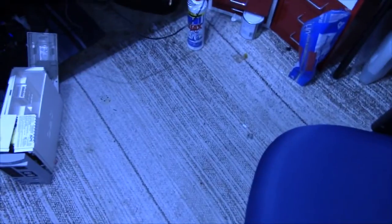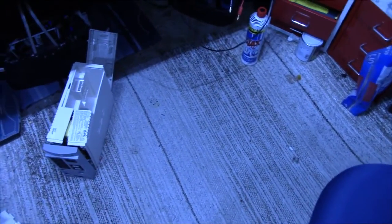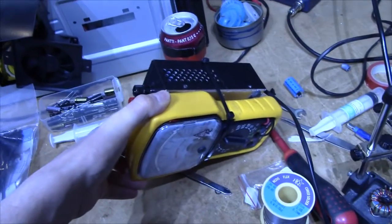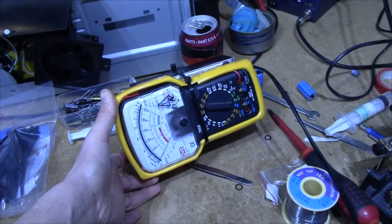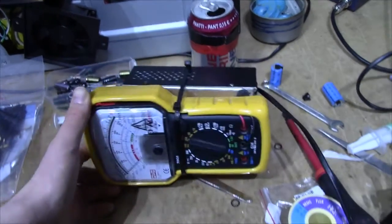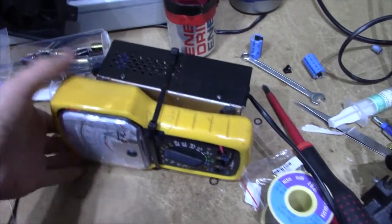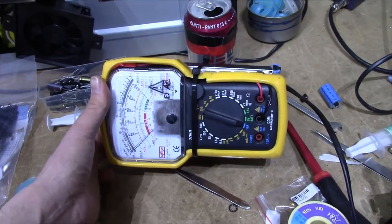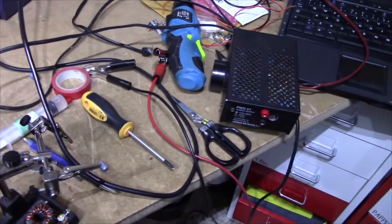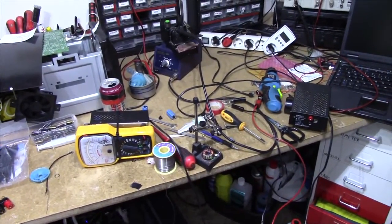I've made a couple of modifications to my main charger. I've added some proper connections - banana plugs instead of just a cable coming out. The output impedance of this charger with the old, very long, thin leads was about 0.3 ohm. Even running through this cheap current meter and the new connection, it's less than 0.1 ohm - quite a considerable decrease, and it's going to perform a lot better. Both chargers are now going to perform pretty much identically. I've set them to 14.6 volts rather than 14.8 now.